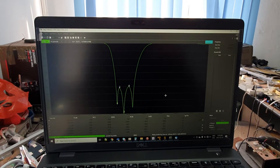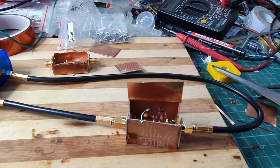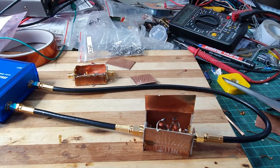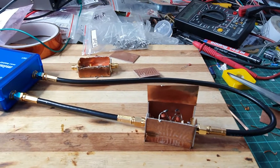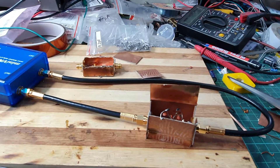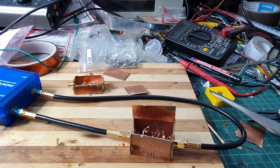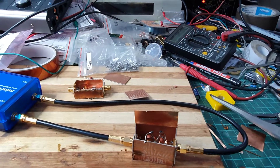This is kind of what I designed — to keep FM stations out of my SDR input, because it was constantly overloaded by FM broadcasts. My goal is not to bring the FM broadcast completely down, because that would require a more complex or active filter. I'm fairly sure a higher-order filter would do better, but I wanted to bring it down enough to prevent issues.